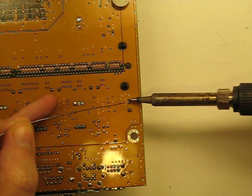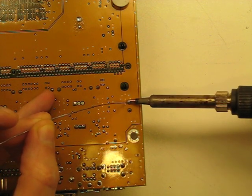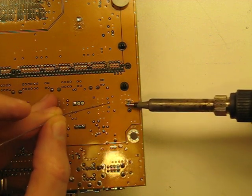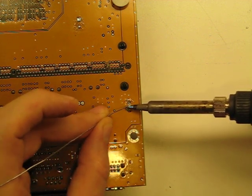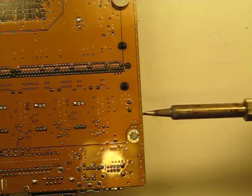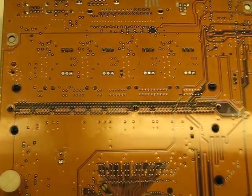What I'm going to start by doing is heat up the joint a little and flow some solder in. The goal here is to create a big enough gob that I can bridge all the way across to both sides. I'm going to rotate this around so that I can get under it with my left hand fairly easily.